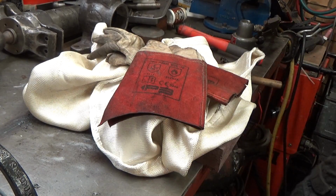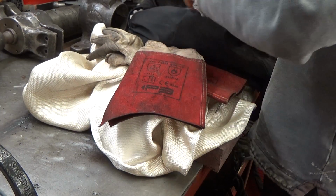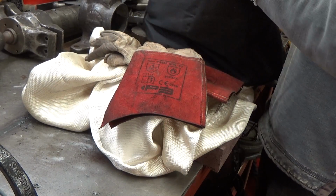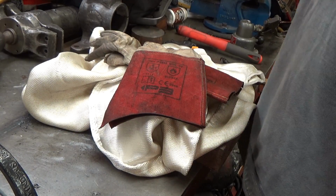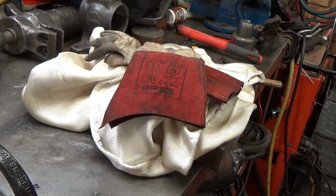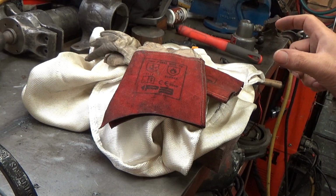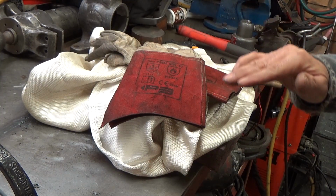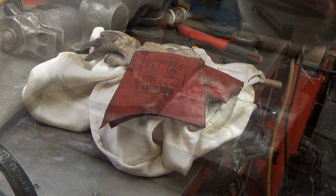You know, I think it's cracked already. So this is just to kind of relieve it any further. I don't know what that's gonna do. It'll put a heat cycle through it and we'll see what it looks like. And then I'm gonna come back out, warm the whole thing, grind down the weld, see if we've got any good weld on it, and then braze it.